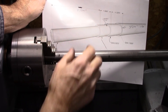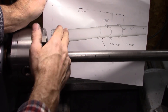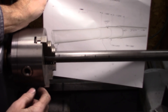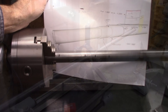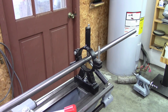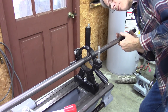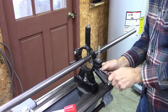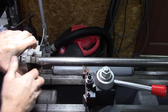I've got the full diameter chucked in my chuck here, and I'm going to undercut that and then cut it off. Then I'll put that 5/8 diameter in my chuck, which will allow me to finish this diameter and cut the threads, and this diameter is 5/8 which will allow me to slip the 3/4 nut over the reduced section. When I cut my threads I'll be able to test the fit for the threads. Hopefully this cuts smooth that far away from the chuck — I may have to move my steady rest in a little bit.